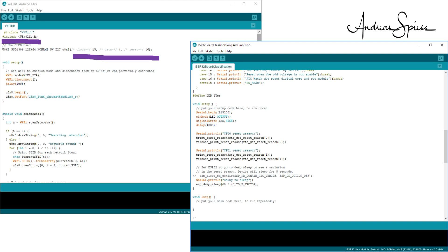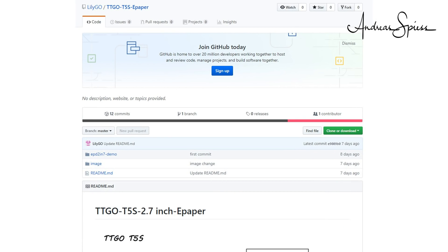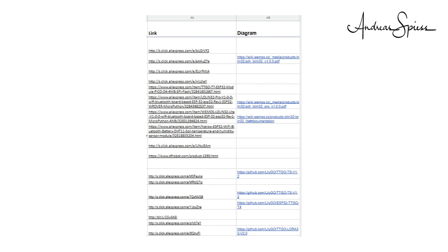It took me some time to find the right sketches and pins. For the ePaper display, however, I only found a sketch for the ESP-IDF, not for the Arduino IDE. You can get this board also with smaller screens and there you find sketches for Arduino. What about the documentation in general? The majority of the boards are from TTGO, and they have proper documentation on GitHub. For the other boards you have to search a little. I posted a link where I found something useful as well as links to the shops. If you know more, please inform me and I will update the info.